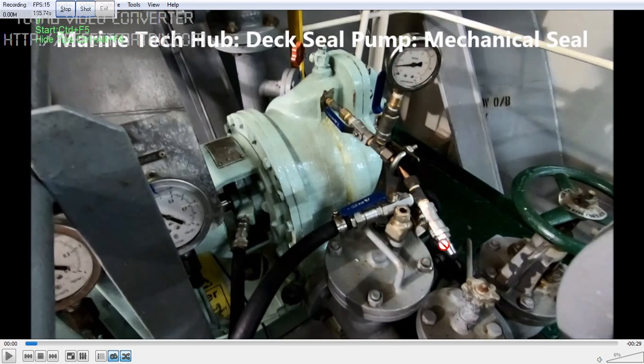You will not give more water than needed — connect the hydrophore line, open this valve, keep the other valve closed. We may be running this pump for cargo discharge, consuming around 1 ton maybe for the full discharge. This is very important — if you can fabricate this arrangement onboard the ship, you are 100% sure the mechanical seal will not leak and you can run a safe ship without much problem. If you like the video please subscribe, and if you have any doubt please let me know. Thank you very much.